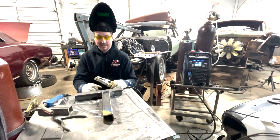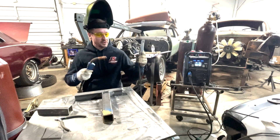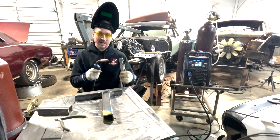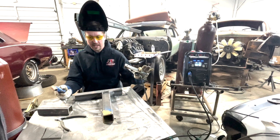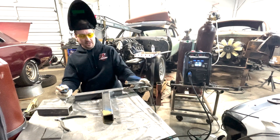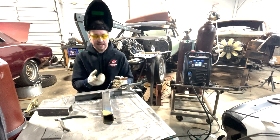Both surfaces are now nice and shiny, so we're ready to weld — we're halfway there, and it's only been about 15 minutes. We've got our torch and our ground clamp — those are the two main components you need for a MIG welder. When you press the trigger it feeds wire, and when it completes the ground circuit it melts into the joint at around 1,500 to 1,700 degrees. A really good tip for hobbyists: get your ground clamp as close as possible to where you're welding. The closer your ground is, the better your weld will flow and the easier it will ignite.